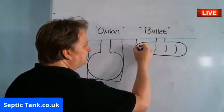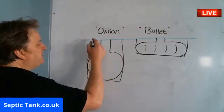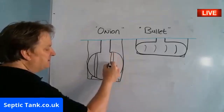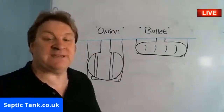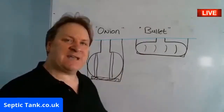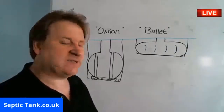The hole for a bullet shaped Septic Tank takes about an hour to install. The onion tank generally takes a day to a day and a half just to dig the hole. Once dug, you also have to anchor onion Septic Tanks down with a concrete lintel, because they have a terrible tendency to pop up out of the ground — I had a guy ring me up just the other day pulling his hair out because his onion tank had popped out. Anchoring uses a concrete lintel and straps, typically costing about two to three hundred pounds. The bullet shaped Septic Tank doesn't need anchoring; because of its design, it just doesn't pop out of the ground.